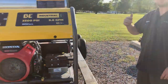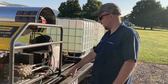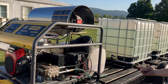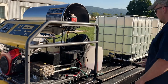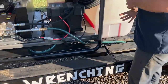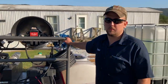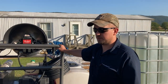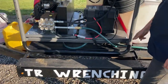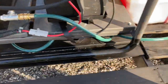If you ever want tips on doing this yourself — I didn't mount the boards directly. I ran a piece of steel and braced it underneath, and ran the cross beams here. There's a cross beam going this way just to help brace that. I was afraid that if I mounted it to the lumber, over time the lumber would just start to rot and get soft. So I wanted something with steel. I slid that piece in, braced it, and bolted it straight down. She ain't going nowhere.